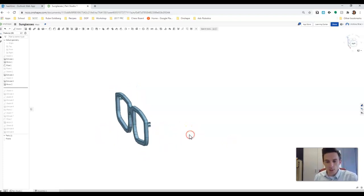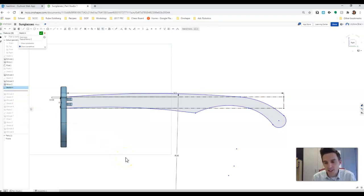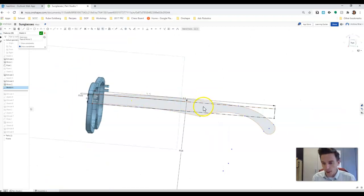Instead of going through step by step here, we're just going to slide down my list, and I'm going to show you what I've done. The first thing I did is I created a sketch, and I based this sketch off of this 5.5-inch box that I created, and then I designed the shape of my ear. Now remember, this 5.5-inch box turned into construction line, so it doesn't bother me later on when I go to extrude. And I have that object drawn. I've closed that object. You can tell it's closed because it's gray.